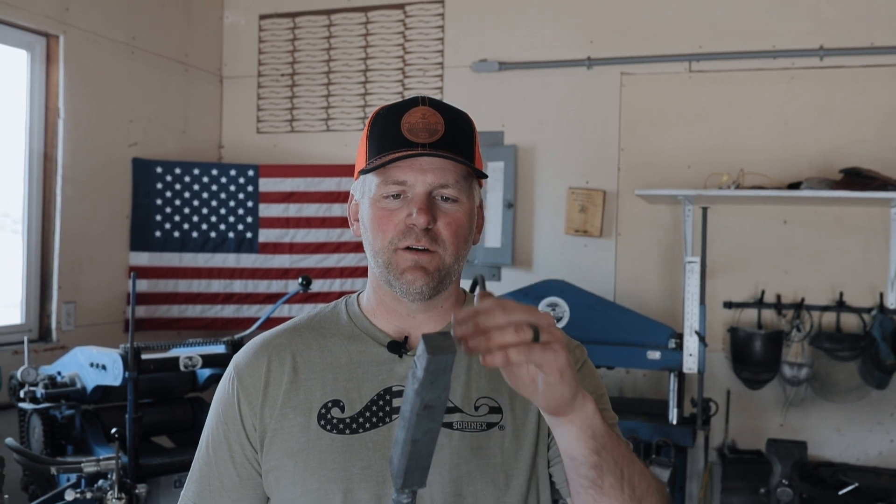I am Josh Smith of Josh Smith Knives. On a previous video we made a billeted Damascus of 1080 and 15N20 — 20 layers. This is 114 layers; we've got an alternating stack of thick and thin layers. We cut that billet in half and set half aside. Now we're going to pick back up on this billet, forge it out into a square bar, and then twist it so all those layers running through the bar spiral around the center. We're going to light the forge, get it hot, and get after it.